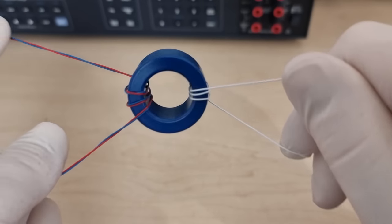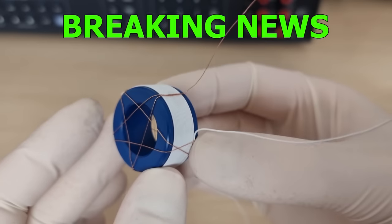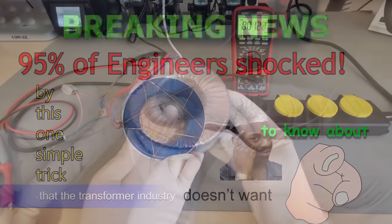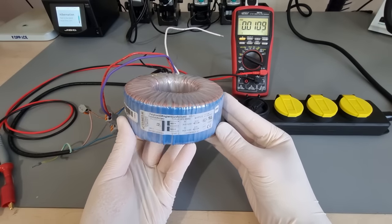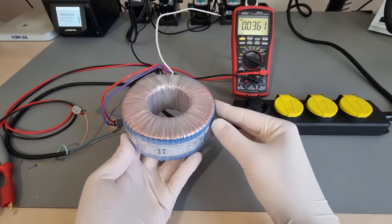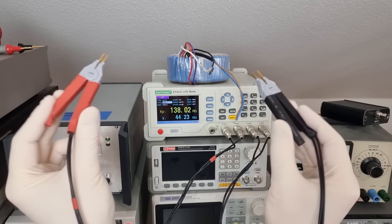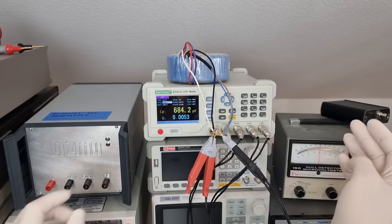Doesn't that sound exciting? No? Well, let me rephrase that. Breaking news: 95% of engineers shocked by this one simple trick that the transformer industry doesn't want you to know about. Ordinary transformers are no good when dealing with sensitive floating circuits. Let's look at the universally respected toroidal transformer, for example. Its primary and secondary windings are directly on top of each other all the way around with only a sub-millimeter film layer in between, giving them the absolute maximum interwinding capacitance.